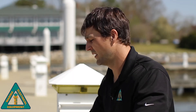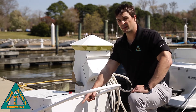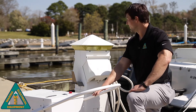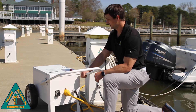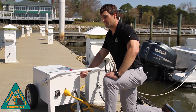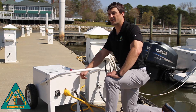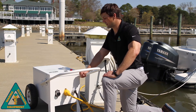The next step is to test for the presence of erroneous neutral ground bonds, which is the most prevalent form of ground faults in vessels and marinas. As soon as you plug in, if the presence of that bond is sensed, this alarm is going to go off. If you encounter this alarm, there's no sense in testing any further, and the vessel cannot be permitted to plug into the AC shore power system of the marina. No further testing is required.